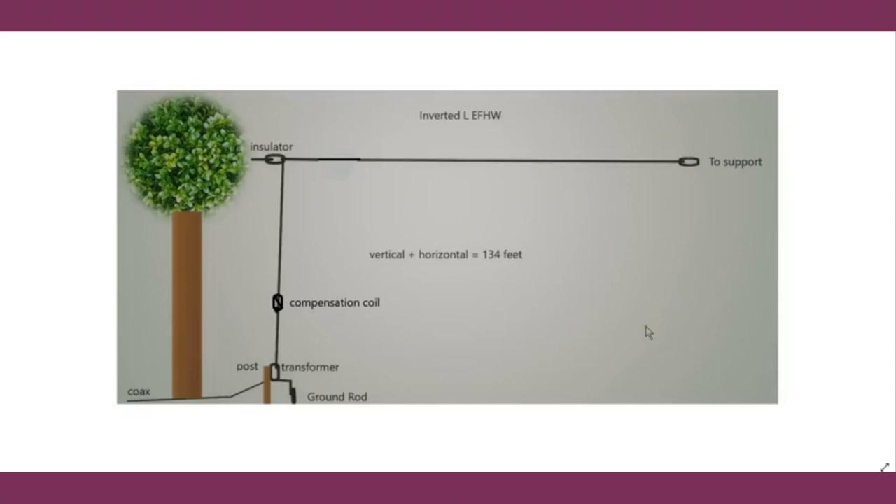The inverted-L version of the antenna gives a combination of radiation characteristics: broadside, end-fire, horizontal polarization, vertical polarization, and omnidirectional coverage from the vertical section. It's a great all-purpose antenna. The only downside is that the vertical portion may pick up noise from your house, so keep any vertical section of the antenna several feet away from the house — not running up against it, where internal wiring or metal insulation can cause high SWR and noise.